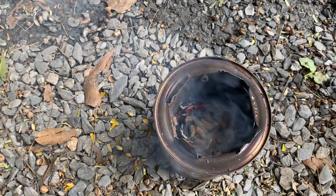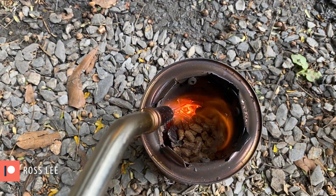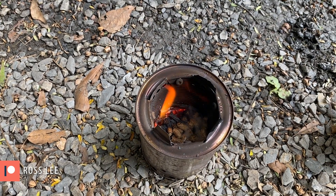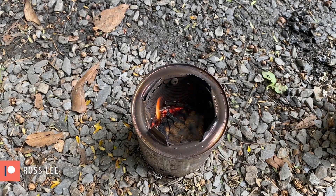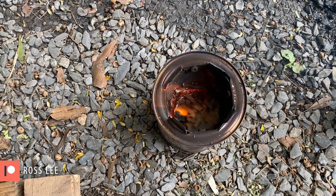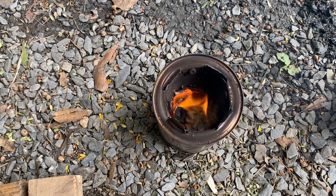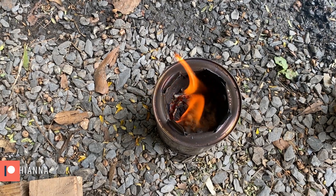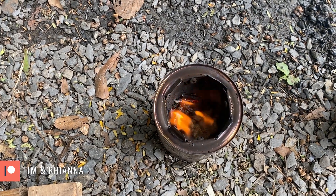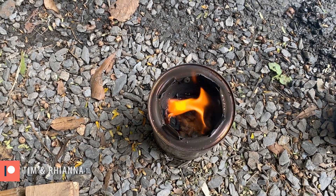I know the wind chimes are a little bit loud right here. One observation is that when the stoves go to coal, adding a little bit more fuel and then hitting again with a torch starts the fire going. You can see the wispy smoke kind of hanging out low over the fuel — the fuel is gasifying, releasing the gases that will burn. And the oxygen flowing in through the air holes is connecting with those gases to form that combustion equation.